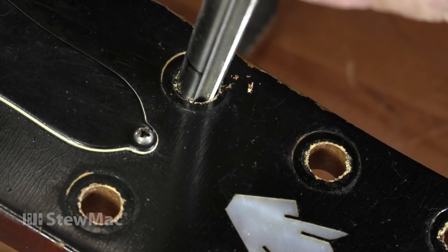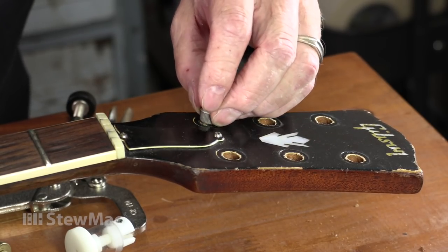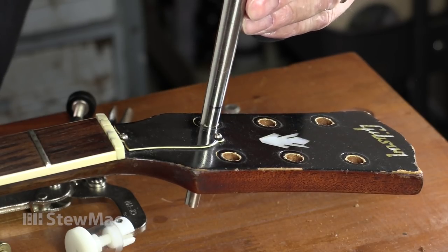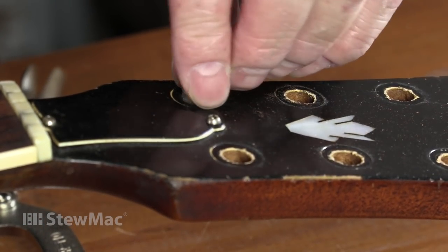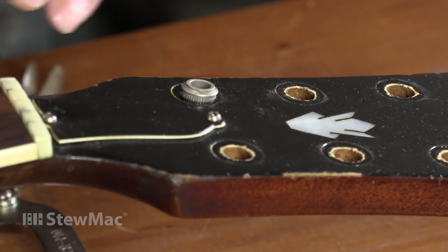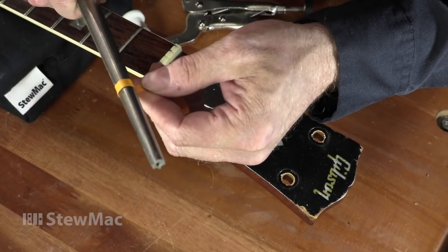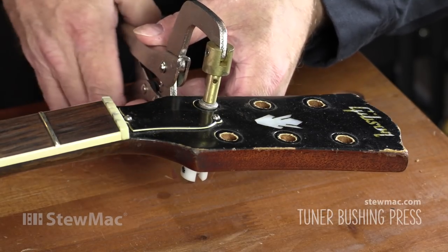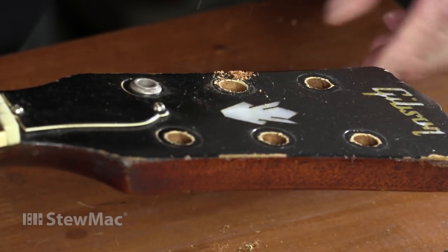A nice slight turn or two more. All right, there we go — starting to seat in the hole. I don't want to go too fast because I don't want to overshoot it; I want these to stay snug for the rest of their lives. That's nice — it's going to go in without a whole lot of pressure and be nice and snug. Once you find the sweet spot, mark it on your reamer with a piece of tape so you know where to stop when reaming the other holes. I'll press this one in to confirm the fit — nice and snug, looks good. Now that I know how deep I need to go, I'm ready to knock the rest of these out and install all the bushings.